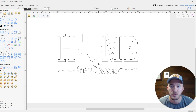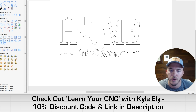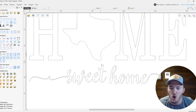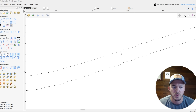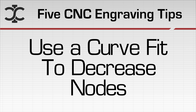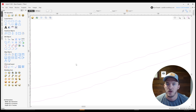This next tip I learned from Kyle Ellie with Learn Your CNC, who has courses on Aspire and VCarve Pro. He gave me a 10% discount code for his course — check the description if interested. The tip: when engraving something like 'home sweet home,' upon closer inspection you may see lots of wavy lines with many nodes. All of those nodes make the V-bit take a lot longer. In the past you'd manually grab an arc, drag it, and cut those lines, which takes a very long time.